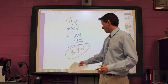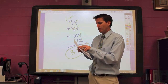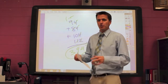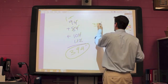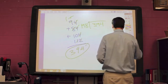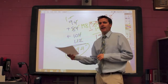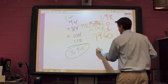Once we've added that together and found out how much paint tape we need, you're going to take the total perimeter and divide that by 198 feet. Why 198 feet? Because this is the coverage of each roll of tape — that's actually how much it covers, 198 feet. So you take 394 and divide it by 198. My answer is 1.98. And again, you can't go to the store and ask for one roll of tape and then 0.98 of another, so you're going to round it up to two rolls.